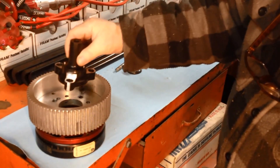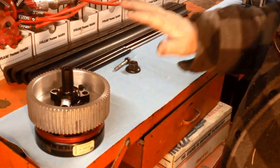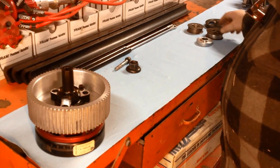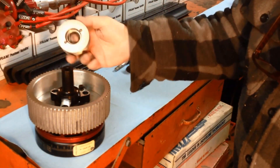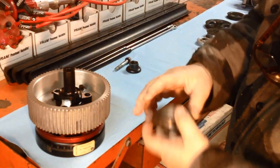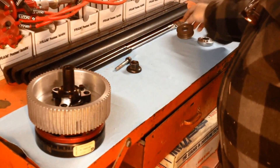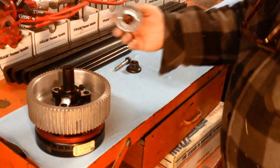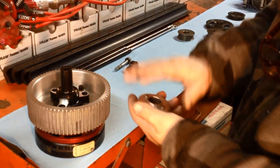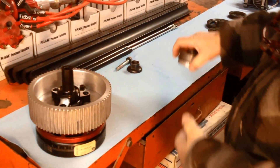Now when you go to put this spindle on, you can use the same three holes for the same bolts that hold everything together so you can stack it all up. As you can see, this sticks out quite a bit. There's two holes in here and two pins on here — they call this a pin drive setup. It's a one-inch arbor, so I can put that on to drive the alternator or put a different size on. There's also an adapter — like a spacer — that you slide down, it engages the pins, and you can stack the next one right up on top. So you can build up a stack and drive three or four things.